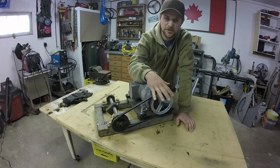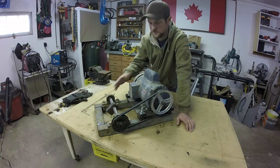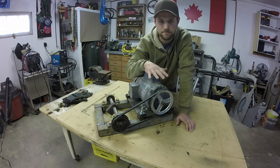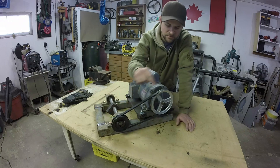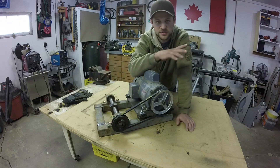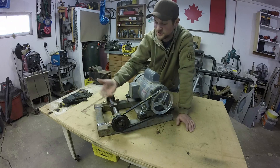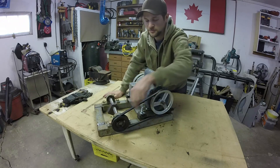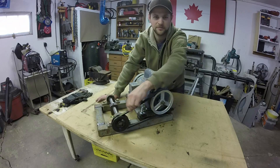This is showing the basic shape of the machine. I have everything rough bolted in just to show where it's going to be and make sure it fits. I did change the pulley size on this motor because this motor spins at around 1700 RPM and I want my shaft spinning probably around 3500. I put a pulley that's about twice the size on here to speed it up. Most packers you buy or rent have a frequency of about 3700, so that's what I'm going for. As the motor spins, I've got a little counterweight on here - I'll probably have to add more - but that's what gives the vibrating action.